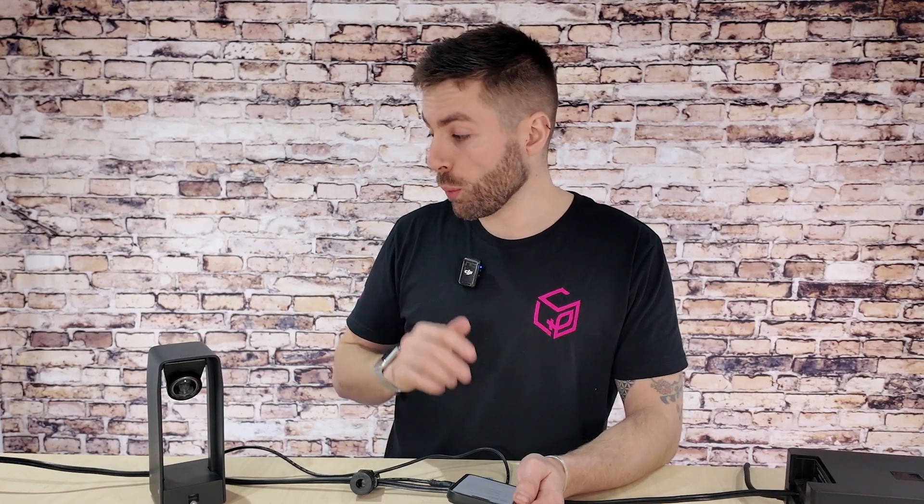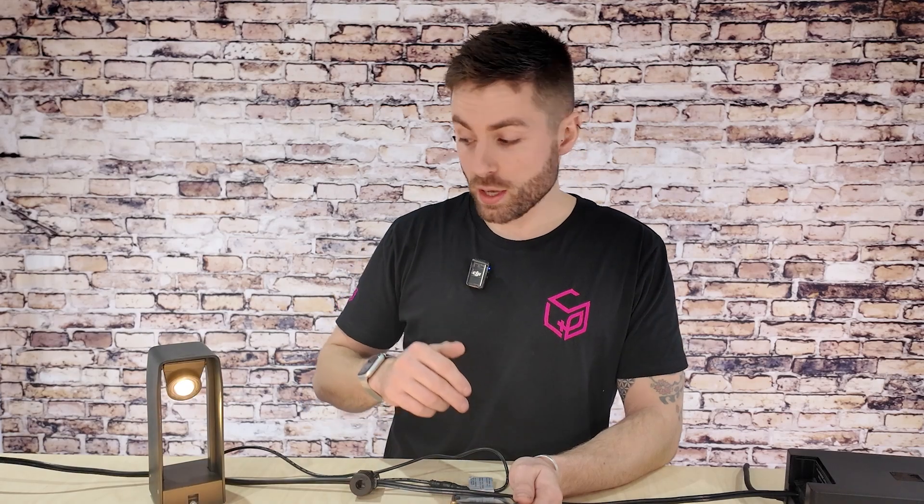So now you have found your hub and named your garden, the next thing you need to do is identify which of your cable routes is which zone on your app. You need to have all your light fittings installed at this point. Then you simply press on one of the zones on your phone, the lights flash, hit 'found' on your phone, and at that point you can name your zone — whether it's driveway, seating area, trees, whatever it needs to be.